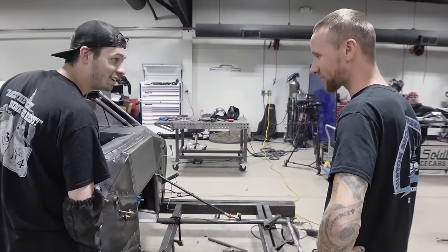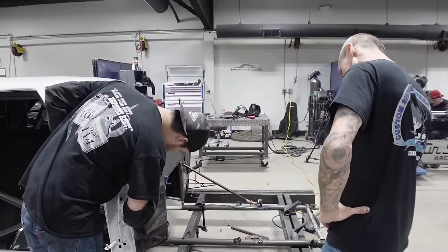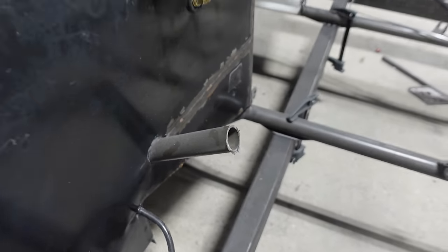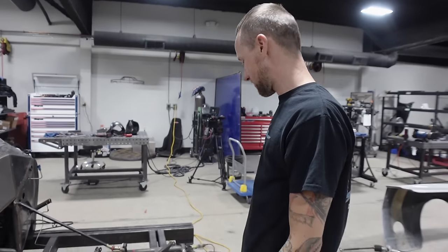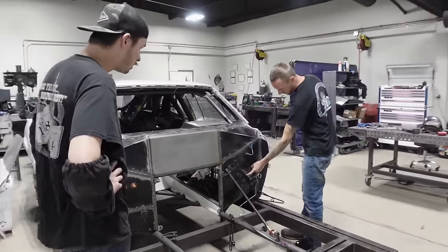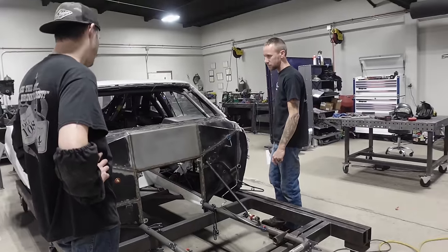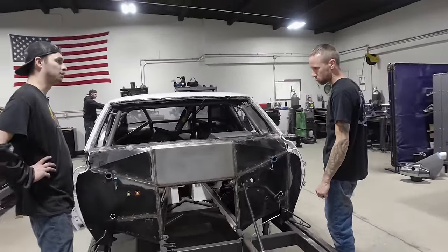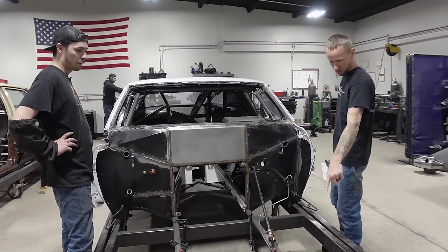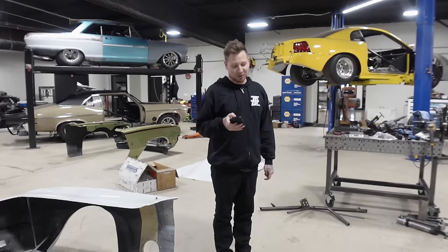Billy didn't know he was getting weight reduction. That is thick — that's got to be 120, might be 83 wall, but that's pretty thick for an inch and a quarter. Actually, I forgot that this one is higher than the tube, so maybe we will slug them low. I tried to leave quite a bit of extra on them just in case. Go ahead and cut the top ones off and clean them up. Todd out here with the sawzall for five minutes and it still looks a little different than when it showed up.